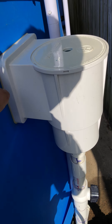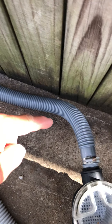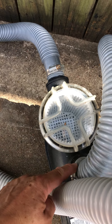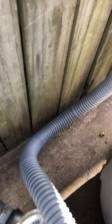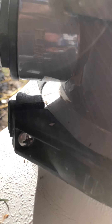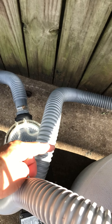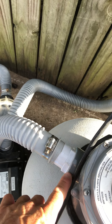So from my pool the water comes in and goes to my pump. It comes into this basket here — this is your inlet and this is your outlet. After your pump does its work, it comes into the sand filter. On the Sand Pro it's labeled as 'pump' and labeled as 'pool,' so water comes in from the pool, goes up through pump, and then this one says 'pool' so it goes back out.